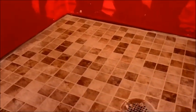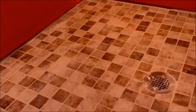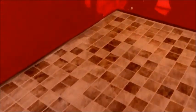And here is the finished product. As I said earlier, tile gets down first, dries overnight, gets grouted, and then that gap exists with the grout in the back. So the next phase is to tile. And once the wall tile goes up, it overlaps that gap, and your tile should be sloped.